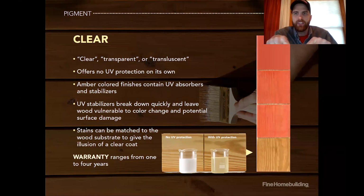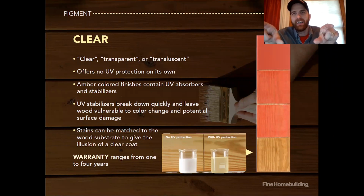And the wood outside of the fasteners is going to tend to expand back as it dries out, and it's going to end up with this cup shape. You may have seen this with a sheet of plywood. If you throw a sheet of plywood down on the ground, it's going to curl like a potato chip because the bottom stays wet from the moisture coming out of the ground, and the top dries in the sun and it curls up. The top is drying more than the bottom. The top shrinks, the bottom stays expanded, and it curls like a potato chip.